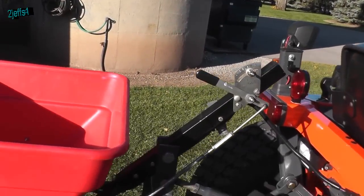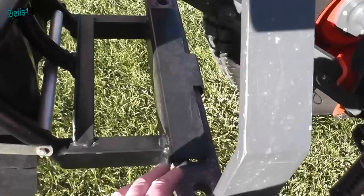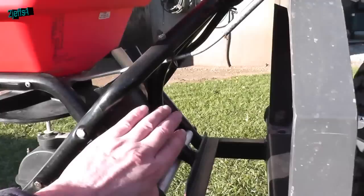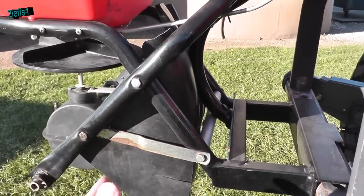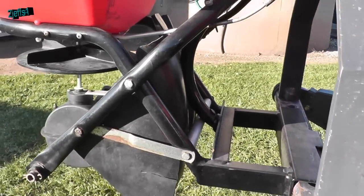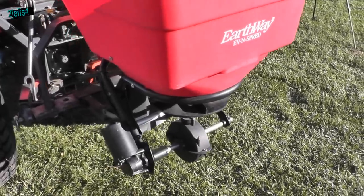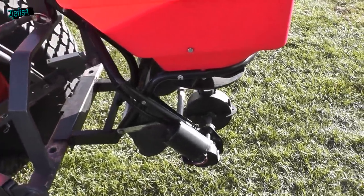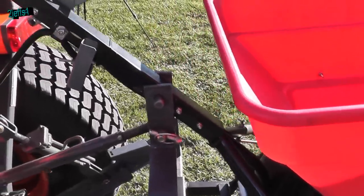On the upper framework, the one-pin is what holds it on. For the lower, I have a u-channel that just sets over the drawbar to keep it all from going under the tractor. In the back I have a plastic wheel tub I had laying around off a Chevrolet car. Wiper motors have wiring for low and high speed — for this purpose I just use the high speed, and I have a switch up here to turn it on and off.